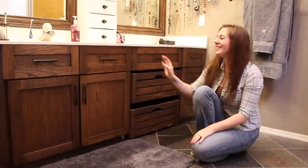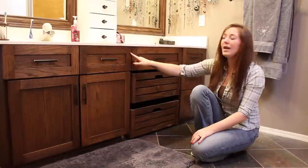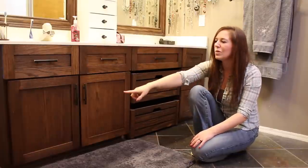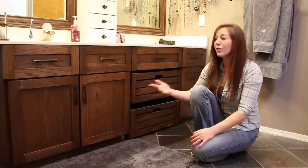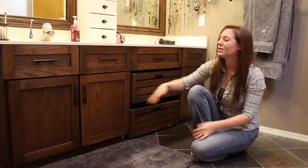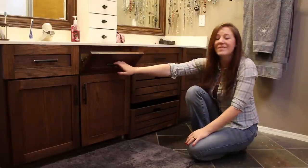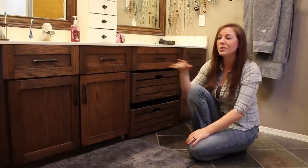I am in love with this. I think that these shaker style doors really do a great job at updating the look of the vanity. I went ahead and took out the majority of the gaps since I was remaking the faces anyway — I was aiming for a quarter of an inch. The only place I ran into a problem was on these doors: I had a two-inch face frame and I could only find one-and-a-quarter-inch overlay hinges, so I'm left with a three-quarter-inch reveal on both outside of these doors, which kind of throws off the look, but I was limited on the hardware available. But these faux faces are now functioning tip-out drawers which gives us a little bit more storage. I didn't like the bins that came with the hardware so I'm just going to end up making my own.